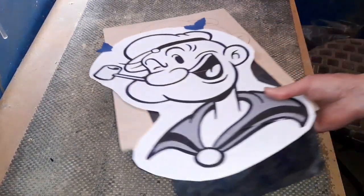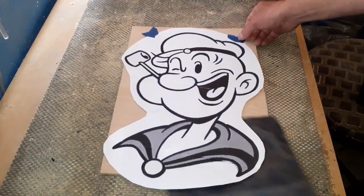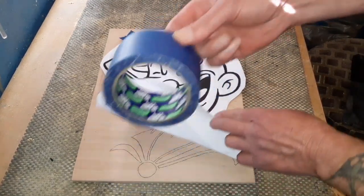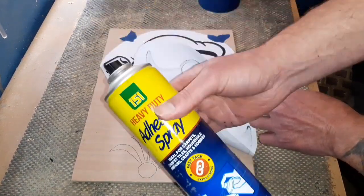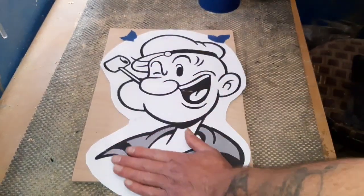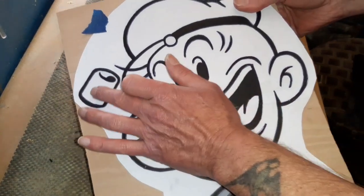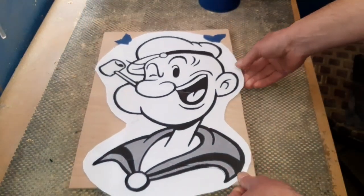on the 5.5mm MDF. Now normally on scroll saw pattern projects, you would literally line that with painter's tape, spray on some glue or some description, just spray that on and stick your template down like so. And the idea, we are going to cut out all the white sections, all the separate bits, and then we'll stick them onto the backer that we've just mentioned.